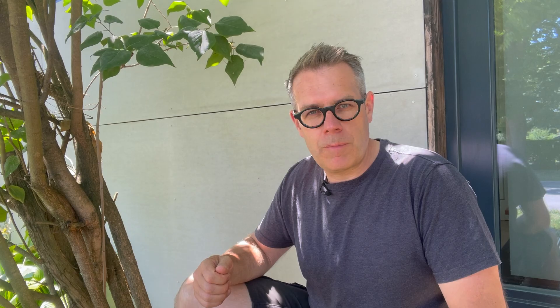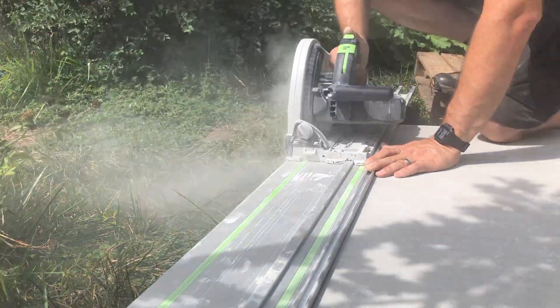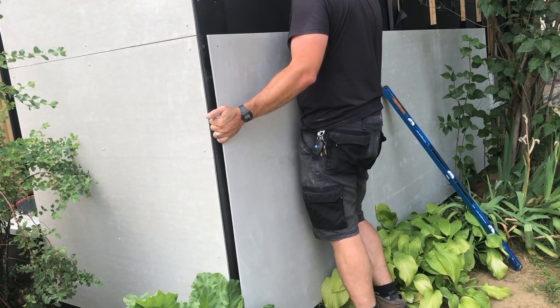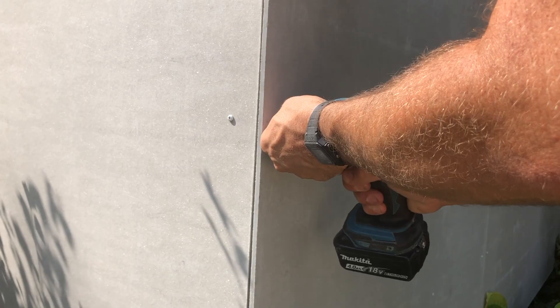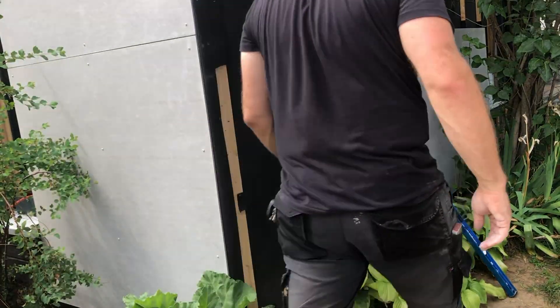With this board there's fiberglass in its composition and no wood, so it is not affected by the freeze-thaw cycle that we have. One thing I noticed after installing this board is that it changes color when it gets wet — just like concrete, it looks darker. Some people may be bothered by that, but I actually kind of like how it responds to the environment. It can be cut very easily; I used the track saw to make straight cuts and then installed it with stainless steel screws. The strapping behind it is two-by-twos, which creates an effective rain screen for any moisture to dry out very quickly.